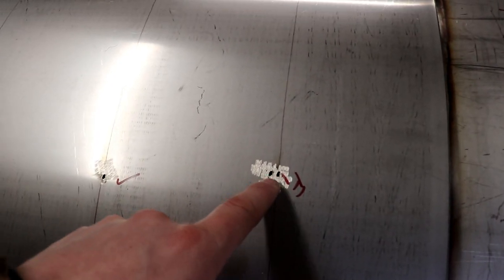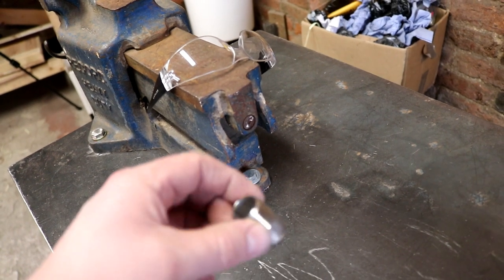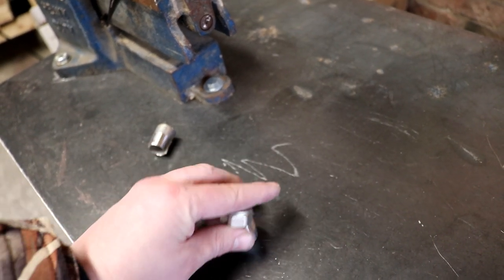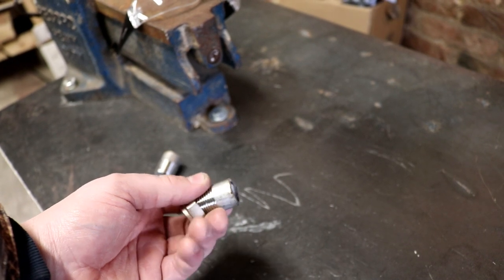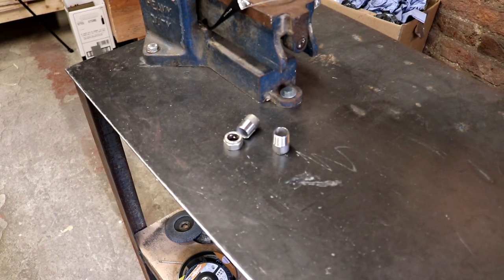Okay, this bit should be easy enough. I've cut the holes for the glycol inlets and outlets. You can see where I missed the inside piece of rod, so I've just got a couple of holes to fill there. And I don't have any more sockets, so I'm changing, that's still hot, I'm changing the sockets out to threaded nipples, but these will accept a copper pipe compression fitting. So I'm quite happy to do that instead, and we'll just come straight onto the copper. You see, with the others I had to put threaded pipes in there anyway, so it probably makes sense to do that, and then we can just stick a piece of copper straight in and we're away. So that's probably a more convenient way of doing it. It's probably more sensible to do it that way.